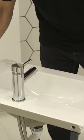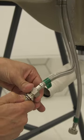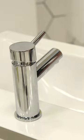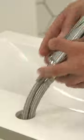We have moved our basin to better demonstrate fitting the tap. First, you need to undo the tap connection. You may need a spanner and grips to do this. Remove the hexagonal nut holding the tap in place — a tap spanner will make this easier. Now you can take out the old tap and wipe down the area.